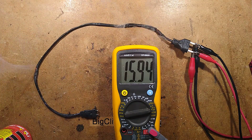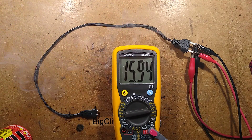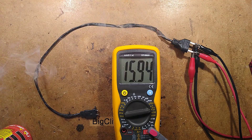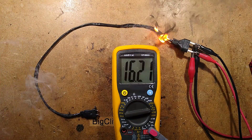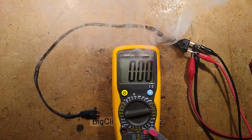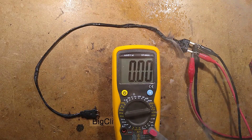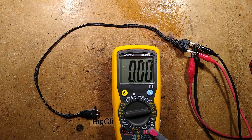Is it just going to burn itself out? It's currently at 3.6 amps. I can't go any higher — the voltage has risen right up to the point where it's capping out on the power supply at the five-amp setting. Let's just extinguish that and turn the power off, because it's going to make a complete mess of the bench. So that was just five amps through one of these cables. If you use that cable in a product that ran at a slightly higher current, or if there was a fault — you saw the voltage across it — that would not end well. That would be quite a dramatic fire starter. That's what happens with some of these cheap products being shipped through grey-market import sources.